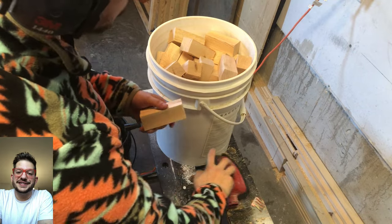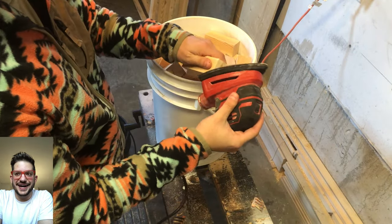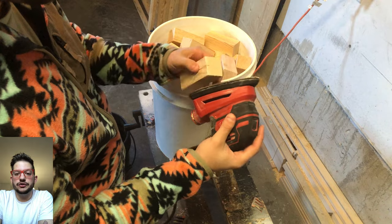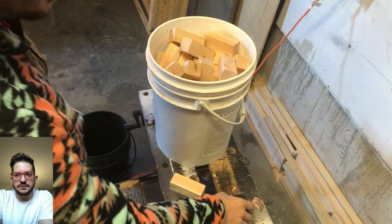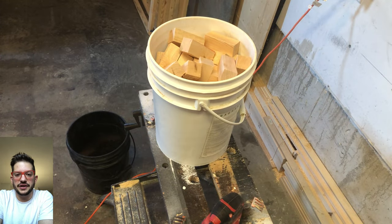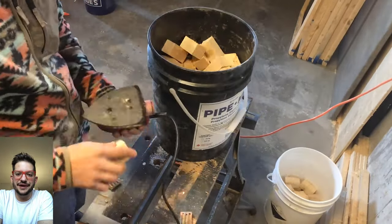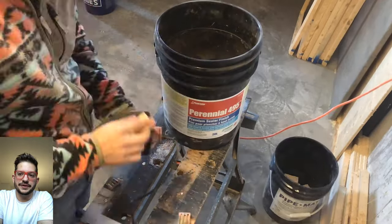Now is the best part — my favorite part — the part that definitely does not suck and take a lot of time: the sanding. I'm sanding to remove the cut marks so that when we glue up the diffuser there are no burrs, no splinters, and the pieces can butt up very flush against each other. This is an important, very time-consuming step, but this attention to detail really pays off in the end when you finally glue up your diffuser.